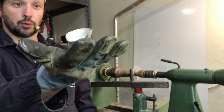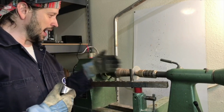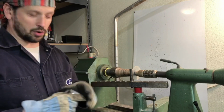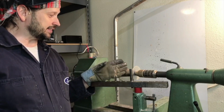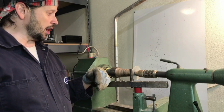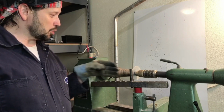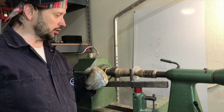And so what I determined is that the angle of that spinning is determined by how far offset you put the blank into the lathe. So I thought I'd make a quick little video about that. And just a couple things to be aware of is since it's offset in the lathe, you can't trim it while you're working, which you can do with normal concentric spinnings. And you need to be really careful with how much force you're using because most of the time the tool will be out on air, just like doing a live edge turning or something like that.